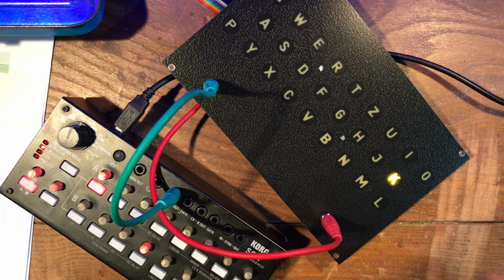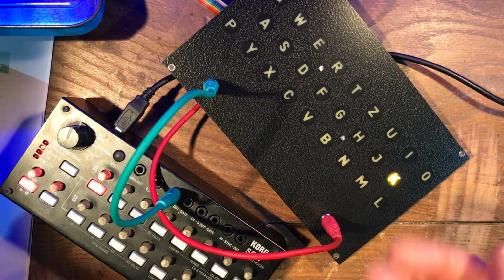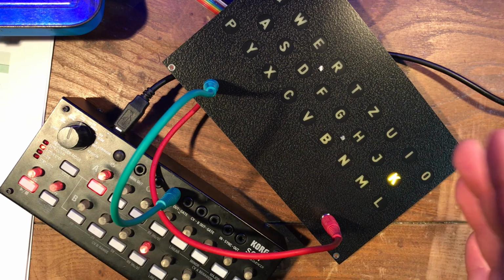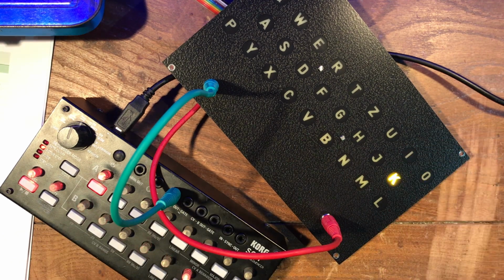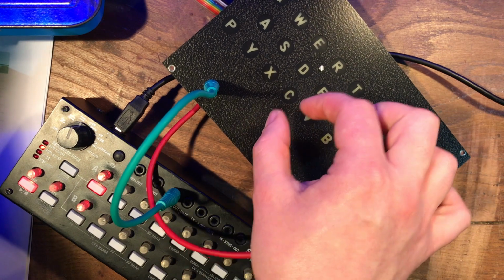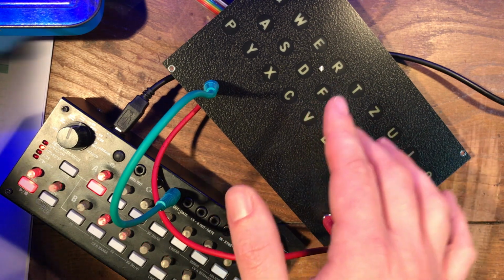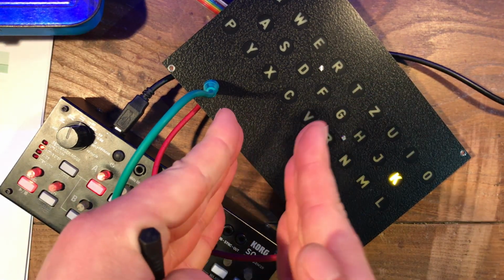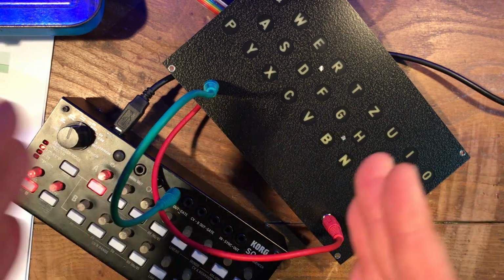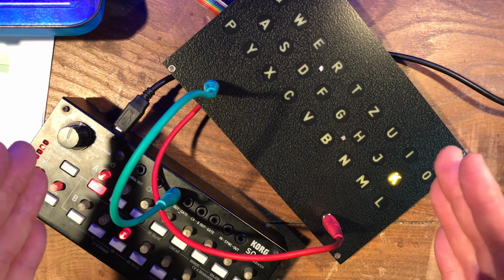Now you probably noticed that as you go up and up in voltage, it's harder to get that trimmer exactly set right. And the reason why is because the errors compound themselves as you go higher in voltage. If you can imagine, each octave has 12 semitones, so you divide 1 volt by 12, that's 0.083 recurring volts assigned as a range for each of these characters. And now if you set that wrong, so you're getting 0.084 volts for example, as you increase the semitones, you're stacking them one on top of each other, that little error is actually adding up, and so by the time you get up to 5 volts worth of semitones all stacked on top of each other, that error is actually making a difference.